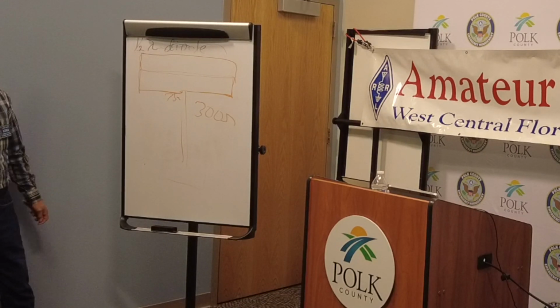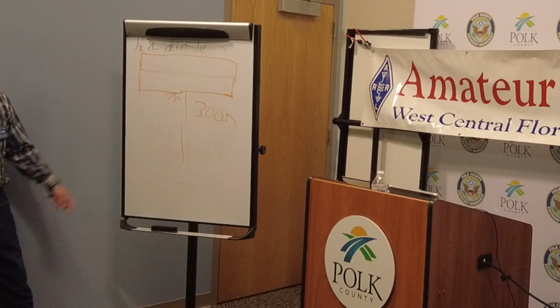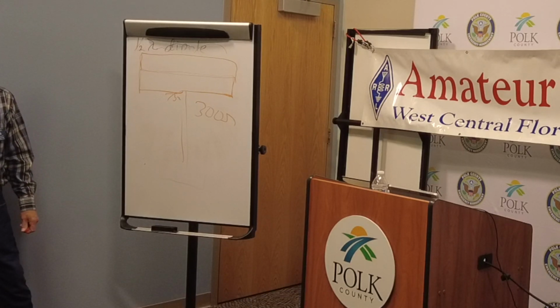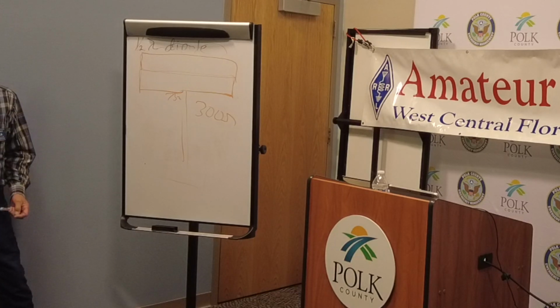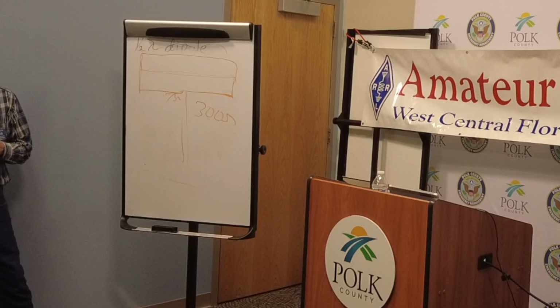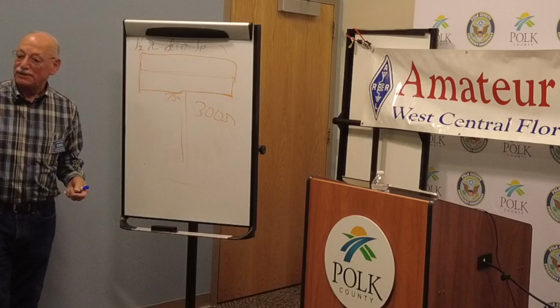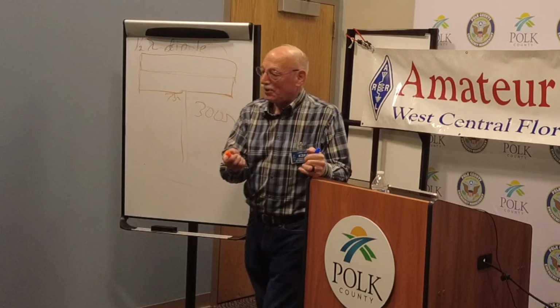If we went to three wires, 9 times 75 is what? 600? 675. Yeah. So you could feed it with 600 ohm twin lead. And once again, why do we like open wire? Lower loss, and it tolerates high SWR.